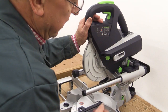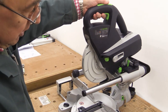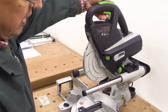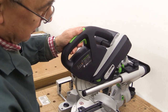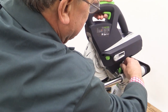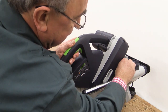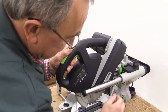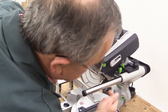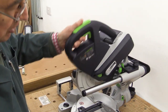It's very simple. If you look here, there is a trenching control. I can go all the way down there. If I move this forward, I'm now in a trenching position. At the moment, it's very high. It's quite fiddly to get at, but to allow it to drop, you can go down, and you can see this is dropping each time I let that out a bit. Now, just be careful when you release this back up, take your thumb away from there, otherwise you'll squish it very slightly. So that's the trenching setting.